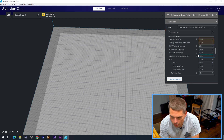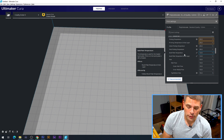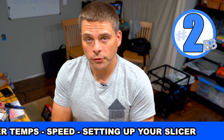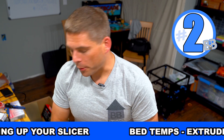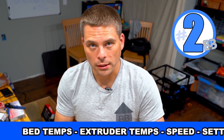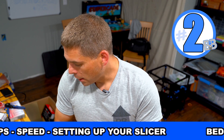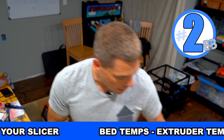My print temperature is at 293. Now, build plate temperature is important: if you're printing polycarbonate or ABS, you want that bed nice and toasty. The warmer the bed, the less chance of delamination on the layers closest to the bed, and the better adhesion you'll have — meaning less warping. That's also another reason we use a brim.